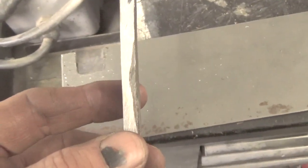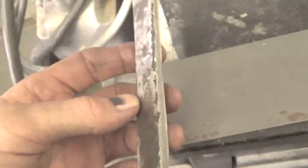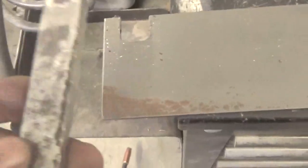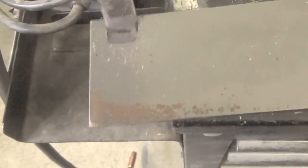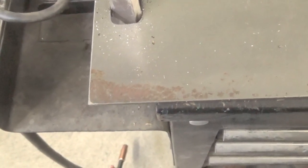So when you make the cutout in the 3/16 for the cam, okay, the cam is very precise, 1/4 inch by 3/4 of an inch. All right, I actually made this from a piece of well casing, but anyway, it's 3/4 inch by 1/4 inch. When you cut this key out of here, the hole, you can't cut it exactly 3/4 because you need to be able to rotate this. So it has to be the distance minimum from one corner to the other.